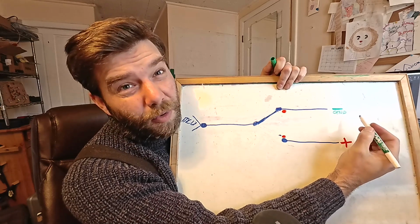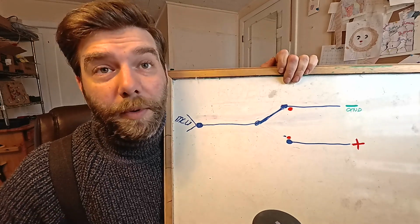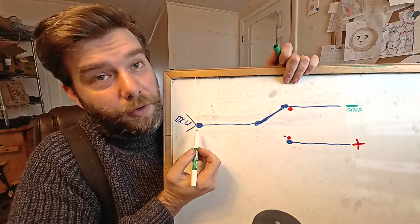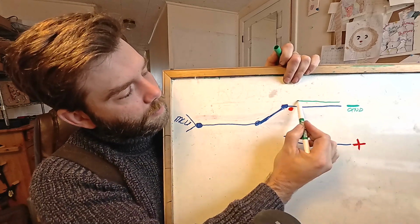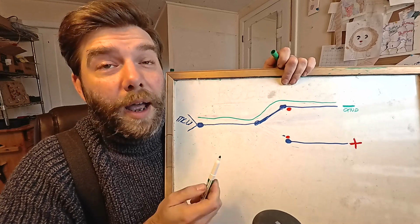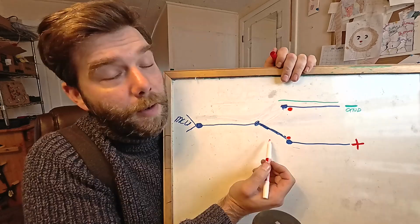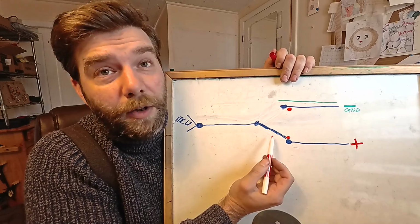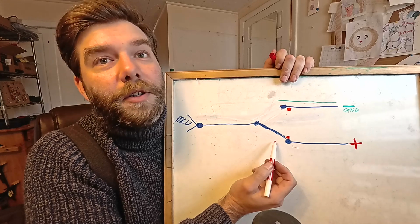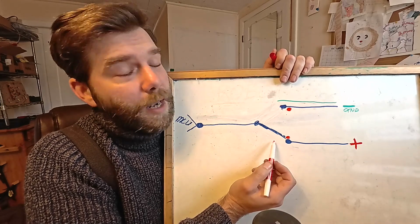I can't write sideways very well. So what's going to happen is, when the bumper isn't pressed, the pin on the Arduino will be connected to the ground rail, giving it a low, an actual 0 in computer terms. But if the bumper gets pushed, the contact will move over to the normally open side, the one that's open when the switch is at rest. Now it's closed because the bumper's been hit.